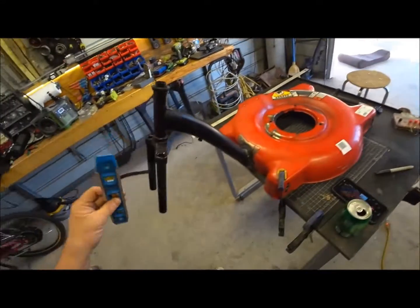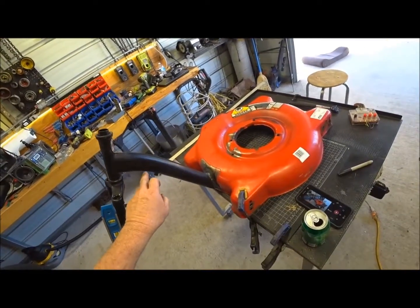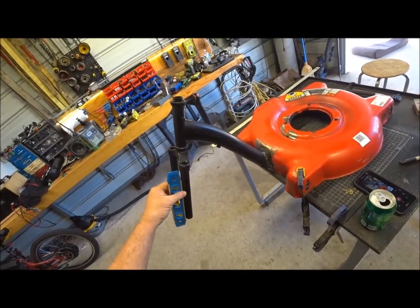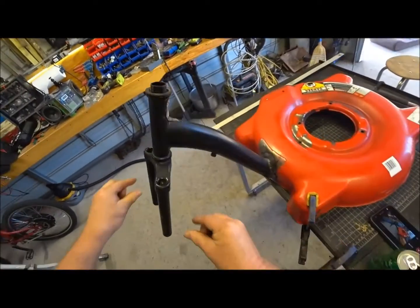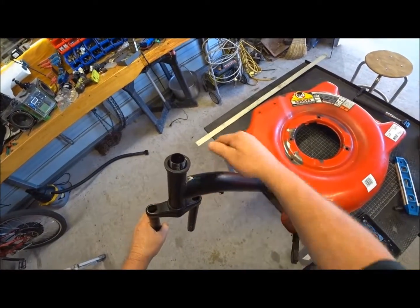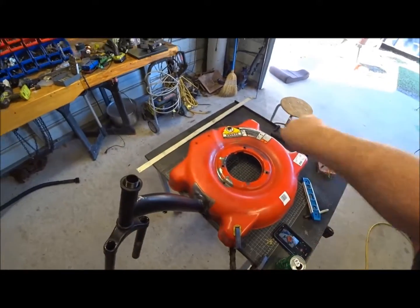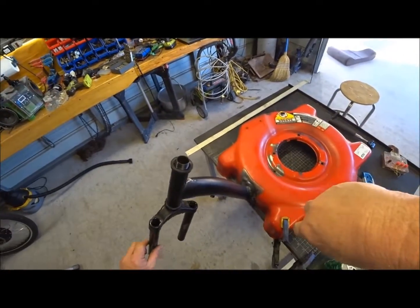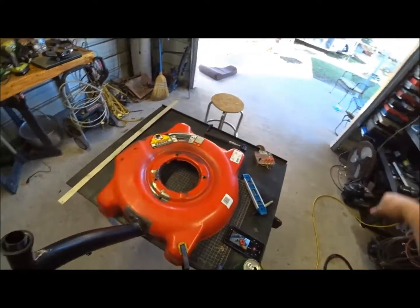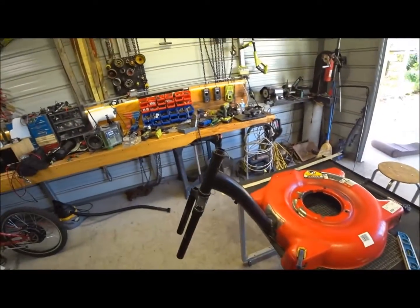What we have to do is get this level. I'll make a series of cuts here and here, bring it in, and then weld it up. The reason being this has to be level, because the gearbox, when it turns it, is going to turn it this way. Even if the motor comes around and wherever I mount it does hit this, this thing is going to pull itself right on around, 360 degrees this way, 360 degrees this way. So you run up to a fence, you turn it, and you can go. Are you going to cut all the grass? You're still going to have to weed eat. You still have to weed eat with a regular conventional mower.